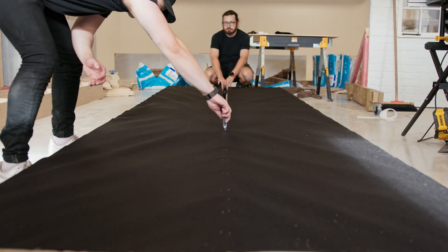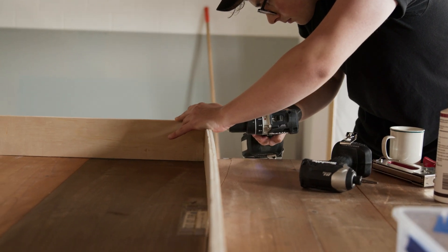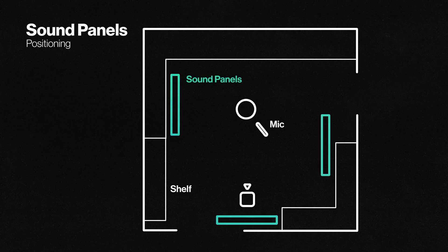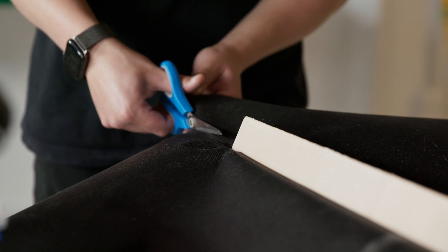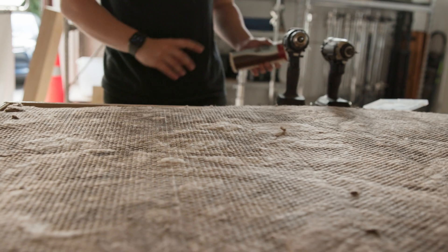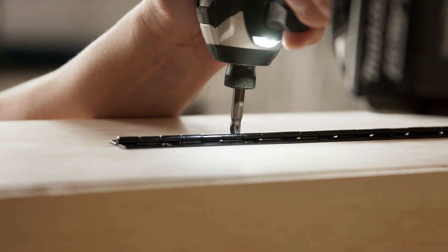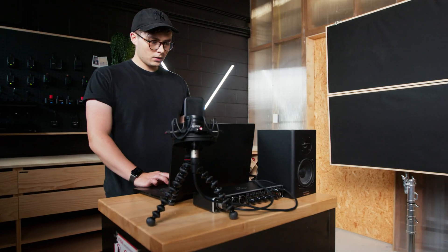We finished adding our fabric and trim with wood PVA and a brad nailer, so these were ready to mount to the roof. Now we're done with our large ceiling panels, but obviously they are very large and unwieldy — we're not going to be moving them anywhere. So in addition, we're building some smaller, more portable folding panels. The idea is to use these to break up the reflections on our left and right parallel walls. With their reduction in size and thickness there will be a trade-off in how much sound they absorb, but with the right placement we should still get an improvement. We're building a plywood box stuffed with the same insulation, covered in sound fabric, and with a perforated plywood back. We added a hinge between the two boxes so they can fold, then attached latches and a baby plate allowing them to be mounted on a light stand.